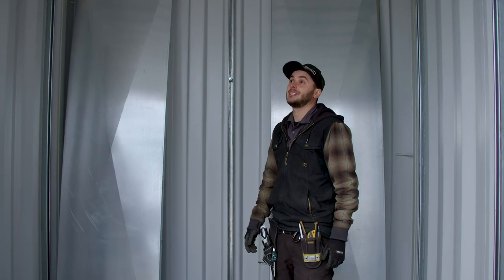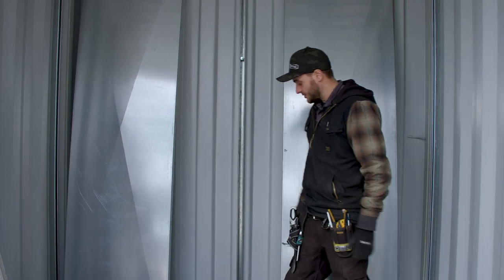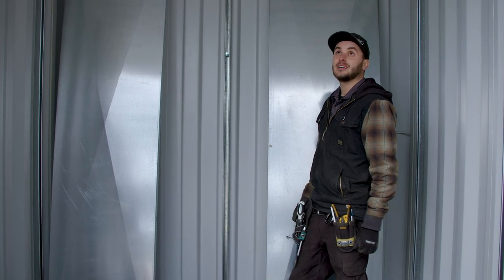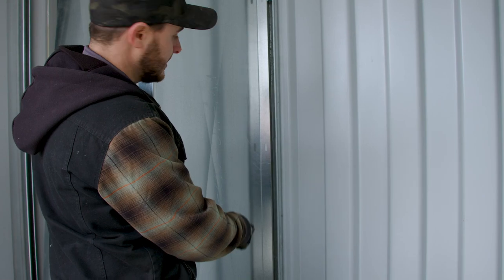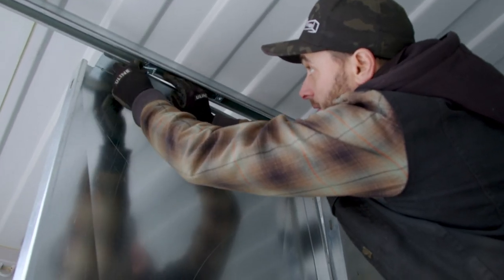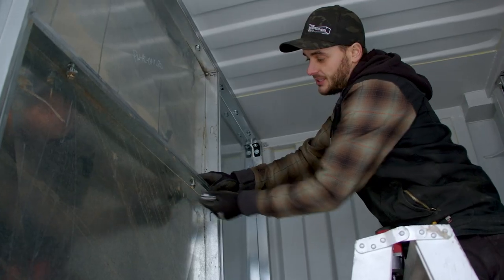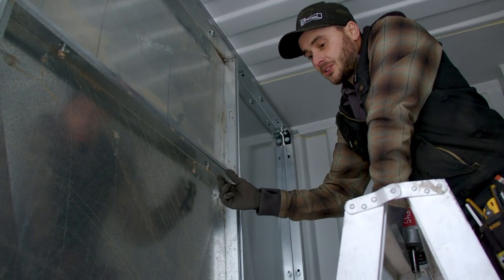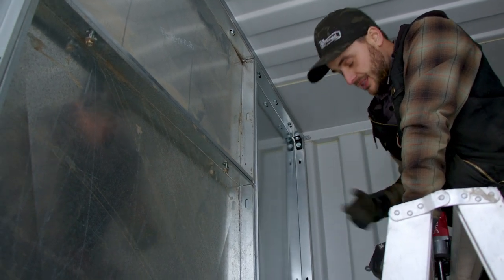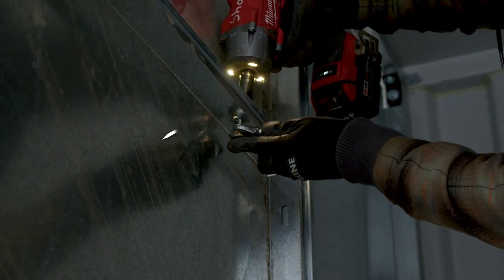We now have the center end wall strut in place, and then the one across the ceiling lengthwise. These partition walls that are meant to go sideways — we're going to turn this lengthwise and install it now. These kits have slotted holes where they get bolted into the strut channel, so you have to make sure that you put your spring nuts in everywhere those holes are prior to putting this in place. With this partition wall kit, we like to use stover nuts — they're like a nylock nut, but without the nylon. It's actually the distortion of the threads in the nut cutting into the bolt, and as you tighten it, it basically locks the nut on there for life.